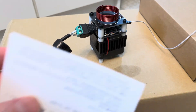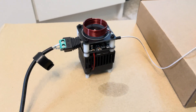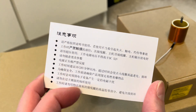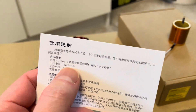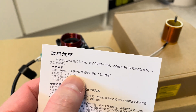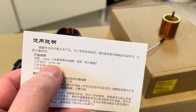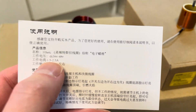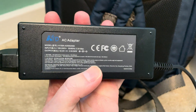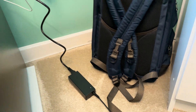Let's talk about the power requirements. This thing isn't easy to power because it requires a minimum of 36 to 48 volts. I've got the spec sheet here — unfortunately the whole thing is in Chinese — but we can see: HFSSTC, input voltage minimum 36 volts to 48 volts, 1.5 amps to 2.5 amps. Most high voltage power adapters top out at 1 amp, which is a problem. But I found a trick: this generic electric scooter charger puts out 42 volts at 2 amps, which is well within range.